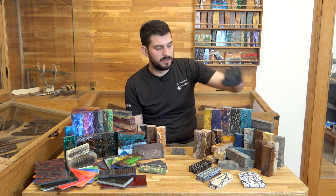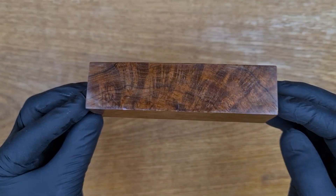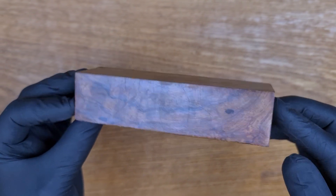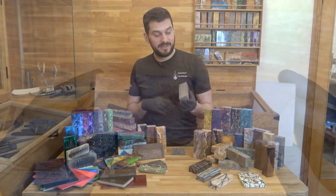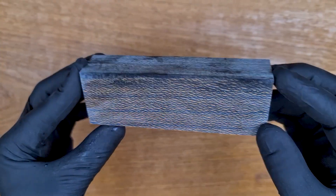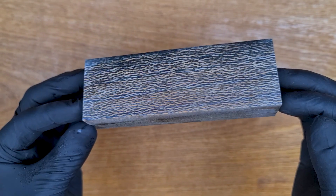One of the classic materials we use is desert ironwood. It comes in various grades — we tend to go for the high grade, grade 15, which is the exhibition grade material. Very high figure, with nice black spalting or medullary rays in it. This one is platan, which has a naturally occurring blue or black vein running through the material. It's very, very tough but makes for awesome handles due to its variations in hue, colour, and grain size.